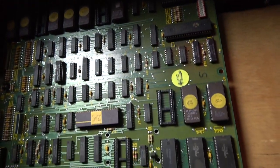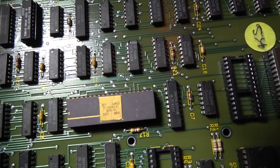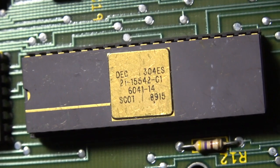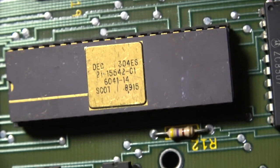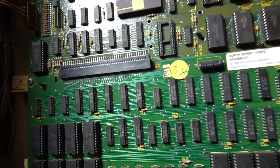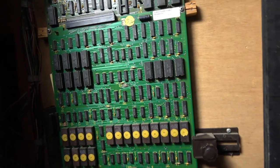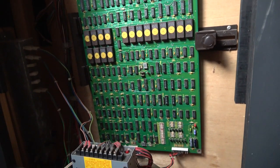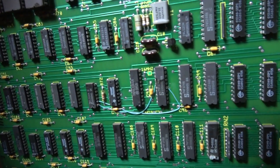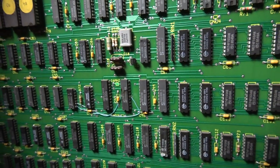Right next to the Yamaha chip we've got the main processor. And this is where it gets interesting — this processor here is not the processor that we want in here. I don't know where this 304ES one came from, so that's not going to help our situation at all. Then we have the main connector going into the video board. This is a really big PCB set — these System 2 setups have a lot of chips, a lot of things that can go wrong. The board has already had some work done on the bottom, which isn't ideal, but does mean it's been repaired.